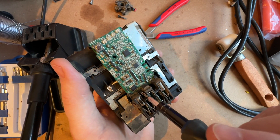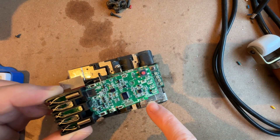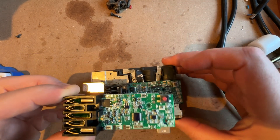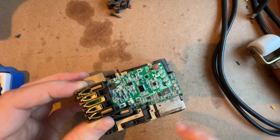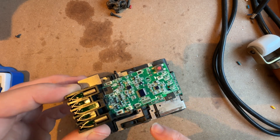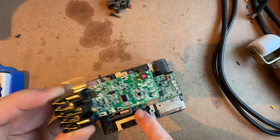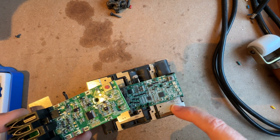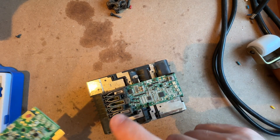Also there's a screw hiding in there. These are spot welded on, on both sides. I'm not going to be spot welding anything — I'm just going to solder. You've got these sensor lines that go between the batteries so you can work out whether or not certain packs are not charging properly. So we need to desolder that one, that one, that one, and that one. Destroy all that, or at least that bit from the original board, and then this should pop out.